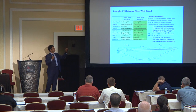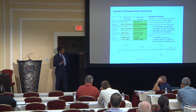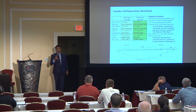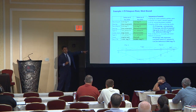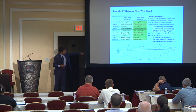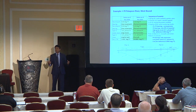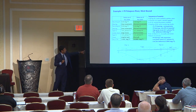This is the westbound bridge, which was quite a different situation from the eastbound. None of the bearings moved. Bearings on Piers 2 and 3, which are in the middle, are on pretty tall piers, so a non-functional bearing is acceptable there because tall piers can handle a little bit of deflection. Pier 1 had fixed bearings — no concern there. However, Pier 4 had a slightly different situation: number one, it is shorter than Piers 2 and 3; and number two, the accumulated expansion of spans 2, 3, and 4 was all applied to Pier 4, creating a combined force pushing on it.